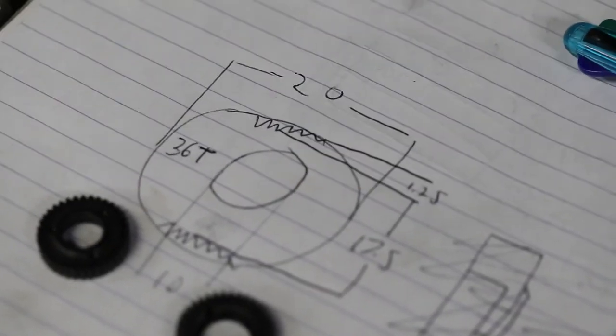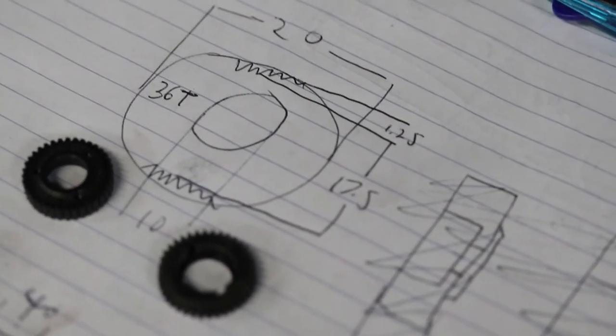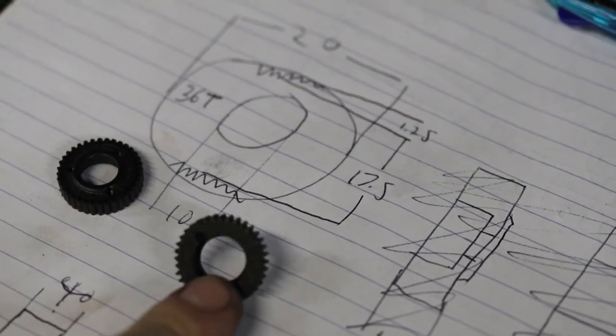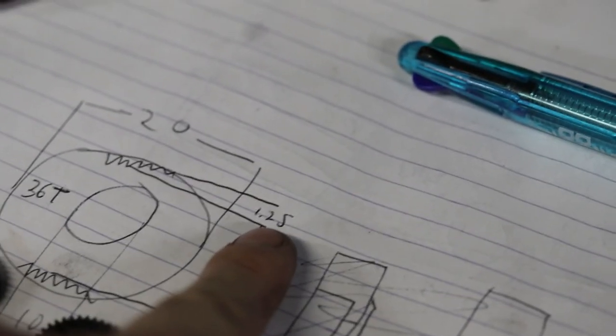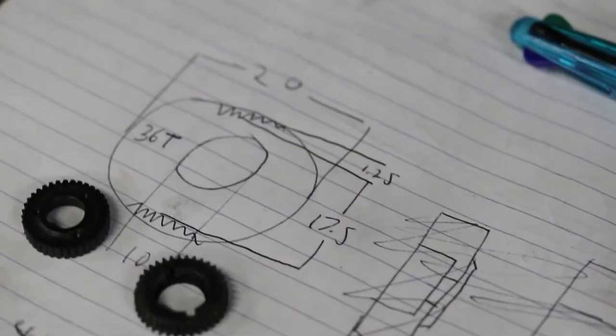So there's my quick and nasty drawing. It's just giving me the outside diameters and how deep I have to cut the teeth. The old gear is here. This is the one that it runs against, so I use this as a reference for how deep the teeth need to be. Obviously it's pretty hard to measure stuff this small, but it looks like the teeth are cut 1.25mm deep, and it should be 20mm outside diameter, so...